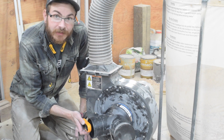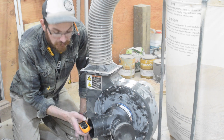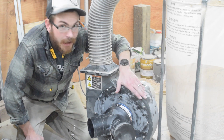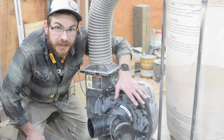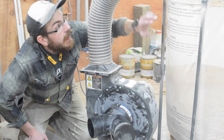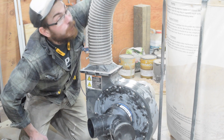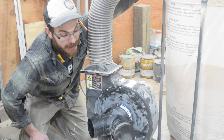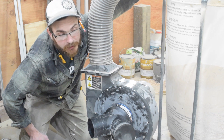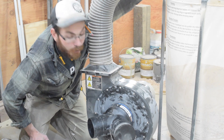What I'm realizing is this small anemometer — changing the angle slightly does greatly change the airspeed reading. But holding it directly as I did with the other test, it is significantly higher. So that's impressive. I can't wait to get this all sealed up because I know I'm leaking air through here. Once that's done, I also want to turn it into a two-stage setup with a dust collector and a cyclone. Then we can actually vent this air outside, which would be incredible — you don't have to push against the air filter or worry about cleaning it. It's not going to be running long enough to greatly impact the heating. So this is a good start.